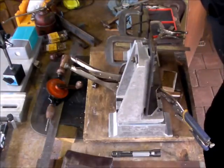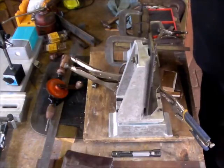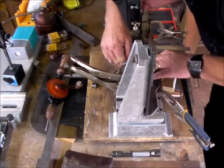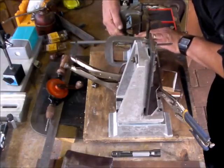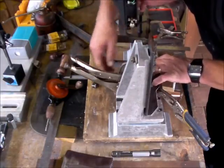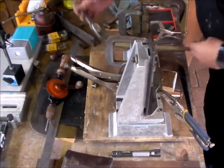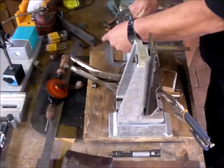I had to go away and reset this up because it just wasn't working. My eyesight's not that great so I had to go to the Imperial Vernier Calipers. I've managed to get this alignment now — we've got pretty much half a thou, and we've got 20, and even less than half a thou. The alignment of this bar is now spot on.